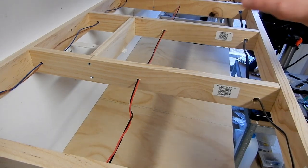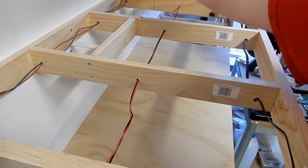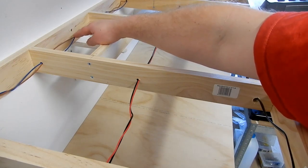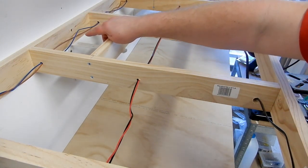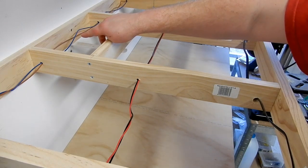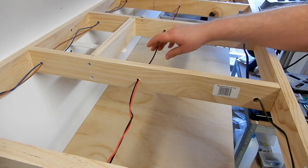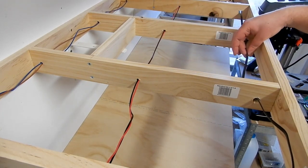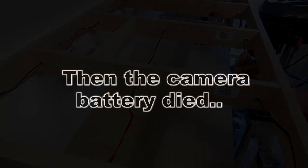So three lots of wiring. As we talked about, here's my blue and brown wiring, essentially going right along the back. That's my accessory bus. Now, that's not going all around the entire layout. It's just going to be in those areas where I've got stations or points of interest where there might be some lamps or other lighting going on. My two red and black wires, which is my main DCC bus. And this black ribbon that you can see on the side here is the cab bus itself, which goes from my DCC.